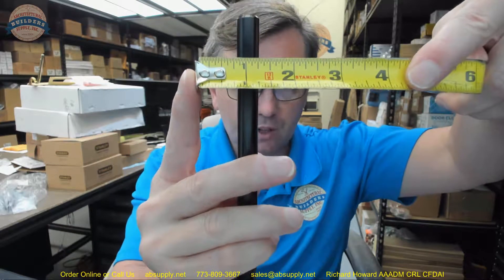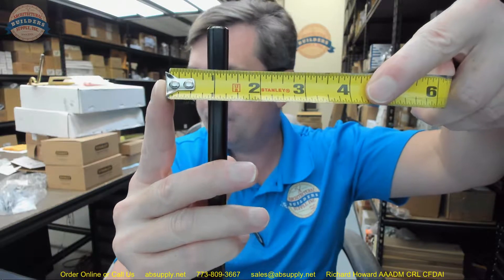Why would you want one a little bit larger? Well, very likely because you have cabinets a little bit taller. You've got a ten-foot ceiling in the kitchen and those cabinets run up a bit taller — you're going to want hardware to be proportional to the overall size. One dimension we didn't take: clearance and the projection. Clearance looks like it's about seven-eighths; overall projection is about one and five-sixteenths.